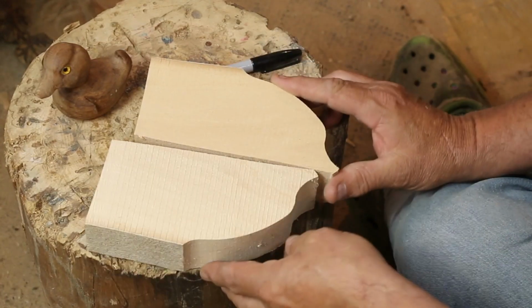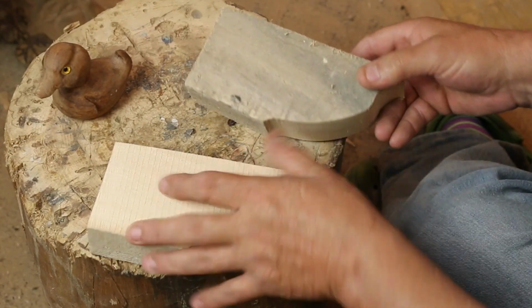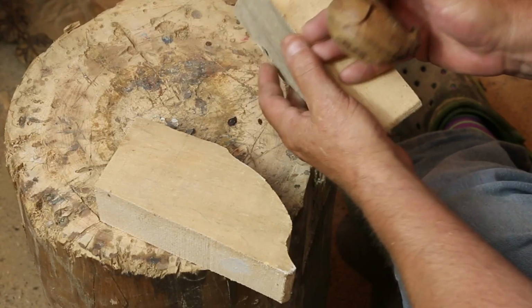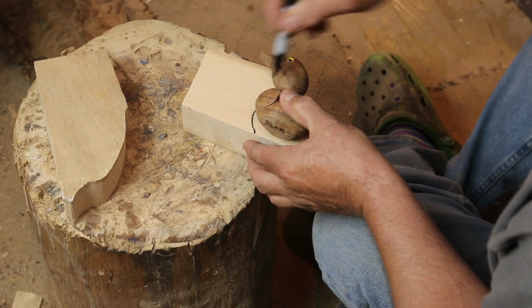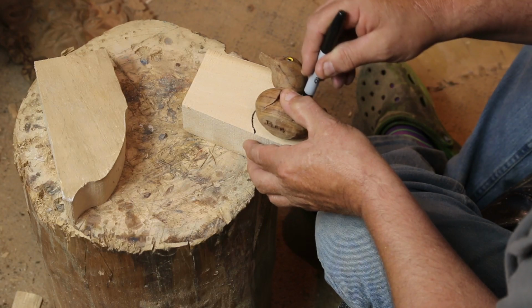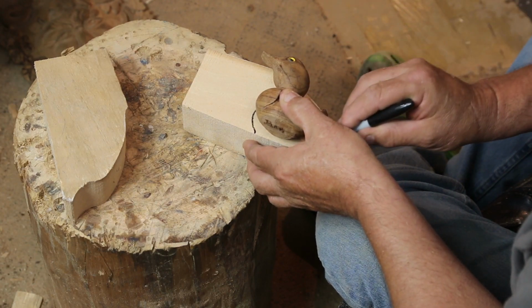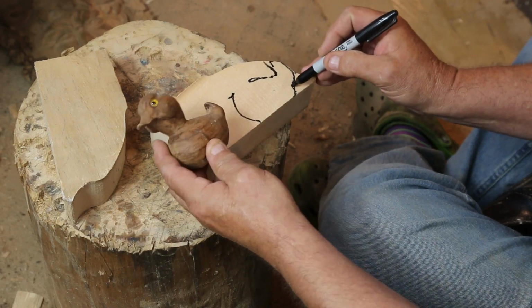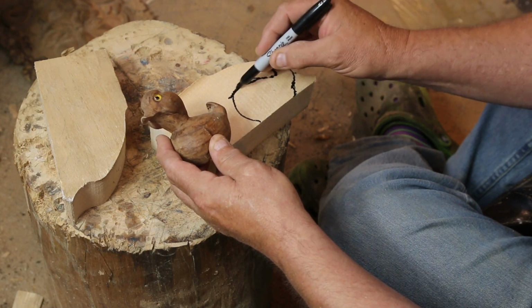Couple pieces of scrap basswood. I was kind of impressed. I looked on the inside of these, and they're really amazingly clean for some reason. I don't know. But we go ahead and lay out the pattern. We'll do it in two parts so that the grain goes across the beak of the bird, and that way if someone karate chops him on the nose, they won't break. And that's a grave danger with the dwarves running around.